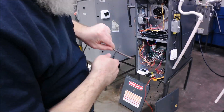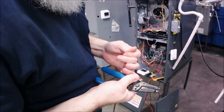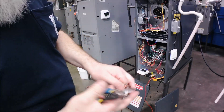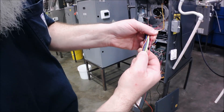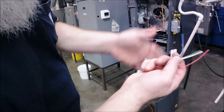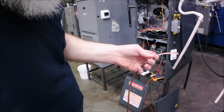I've got a new piece of thermostat wire. A lot of guys use the biggest hole on their wire strippers — but when you do that, yes, you cut through the brown jacket, and you expose the pull thread to tear that jacket even further. That nylon is there to cut a slit in that sheathing. But what happens when you first squeeze that — look, I almost cut through the orange wire just trying to get that brown insulation off. I can see the blue is nicked, the brown is nicked, the white and the yellow. I just nicked all those wires. Wherever I use my strippers to cut that insulation, I go back about a quarter to a half inch and get rid of all that.